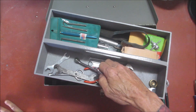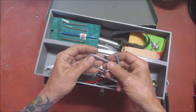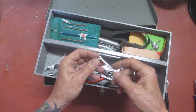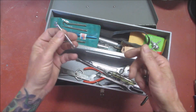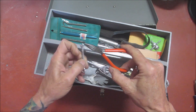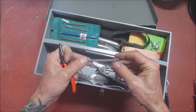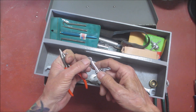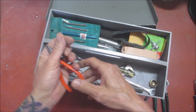These are something probably a lot of folks don't have — tiny little wrenches. This size here is 5/32, which actually fits on the end of the generator tip to unscrew it. Most of the time everyone just uses needle nose pliers, but that's actually the correct size. This size here, which is 7/32, actually fits on the pump for pumps that have the ends that screw on.